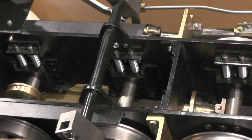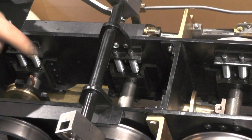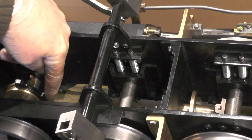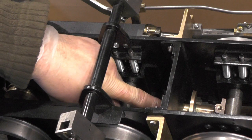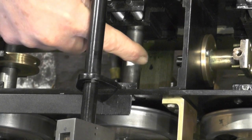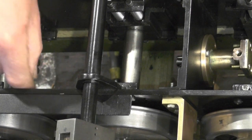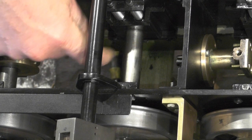Once the eccentric is fitted and the eccentric strap, I've got to come off the rear with a connecting rod over this axle to pick up the slot in the piston there, to make the con rod for the axle pump. I've obviously got to get a connecting rod to bridge this axle.